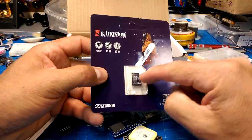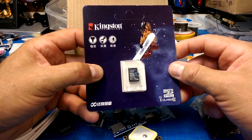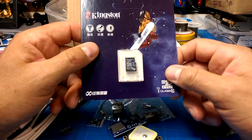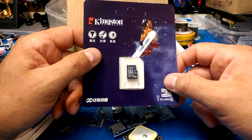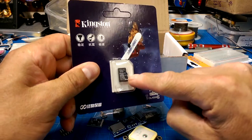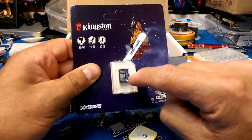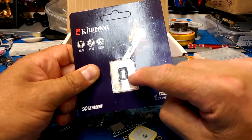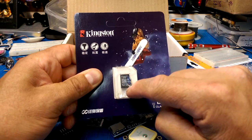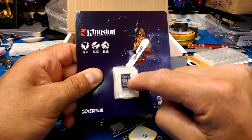Micro SD cards are notoriously fakeable. In Shenzhen, you can get them written to whatever size you want inside of the firmware. These things are amazing, actually — they have a microcontroller in them, because it is cheaper to put a microcontroller in them than it is to bin these chips into different sizes. I see it's a 16 gig — well, at least that's what it says on the front. It's cheaper to put a microcontroller on here to run an OS to manage bad blocks inside of the chip than it is to actually bin these into the correct sizes.